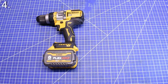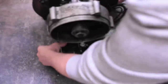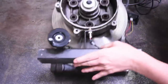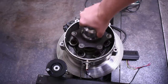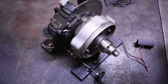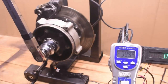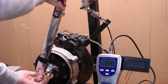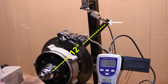This is a dyno brake — literally a brake caliper and disc mounted with a force gauge. One of the most old-school and reliably precise methods of determining torque of anything that spins. It even works in static form with a torque wrench to verify it's working — 50 foot-pounds here, shooting for 75 foot-pounds now — and this thing is bang on every time because the sensor is hooked up exactly 12 inches from the center axis.